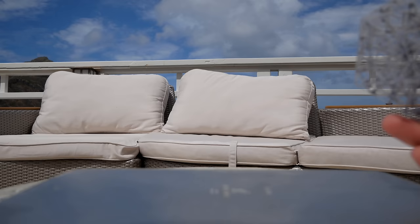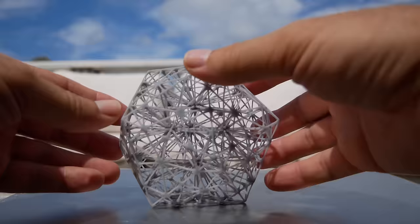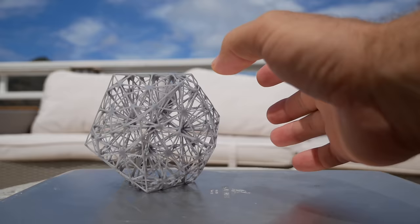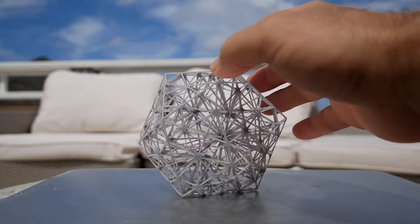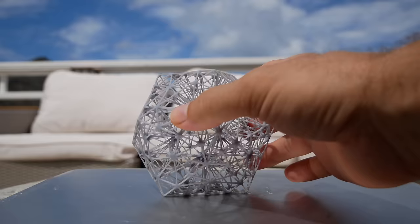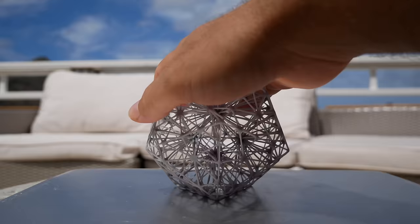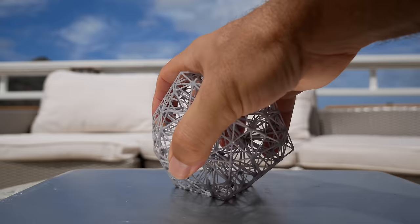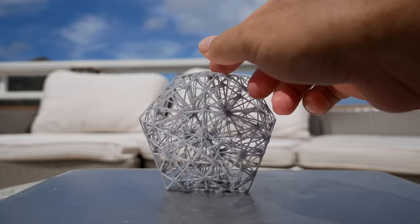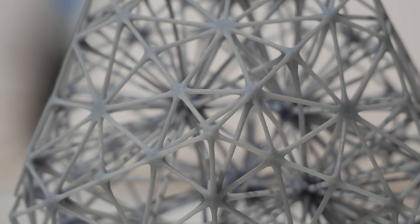The last print is a fine, fragile geometric piece — like a neuron connection with a lot of geometry, a complex asymmetrical shape. I printed it straight to the plate without any support and it turned out great. It's surprisingly strong — the UV curing rate is very adequate even for something this fragile. You can put quite a lot of pressure on it without breaking it. Zooming in as much as possible, you can really see the resolution quality of this print.